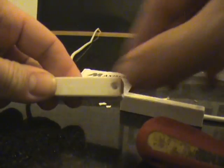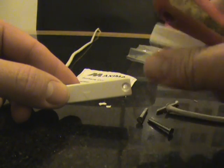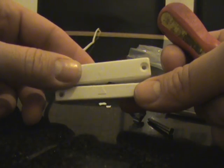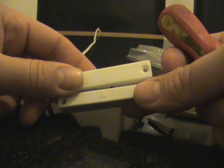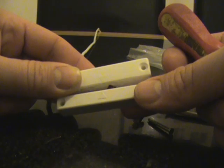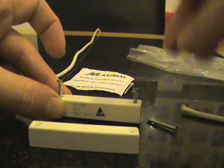The other thing to note is that with this contact you have a triangle here, and also on the magnet you will find that there is also a triangle on the magnet as well. When you are fitting these to the doors it is a good idea to get these two to sit as close as we can without them actually touching, and to get the arrows to point to each other just to make sure that it all lines up correctly. Once you have marked that up we can then put the screws in and tighten them up to the door frame.